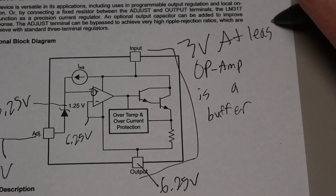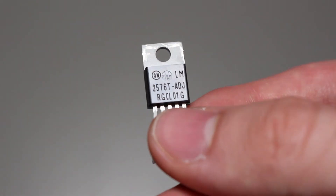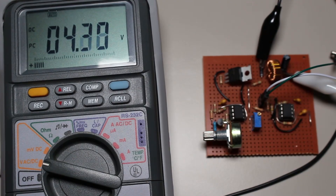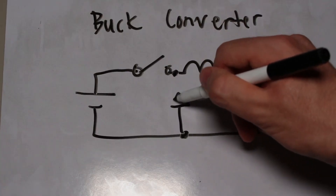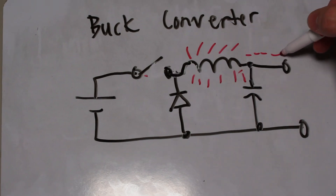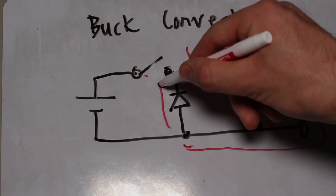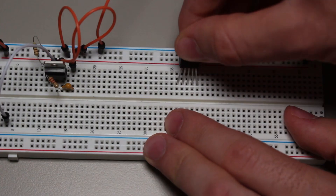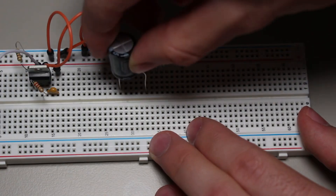Now, we can focus on the switching regulator. In this case, I will use the LM2576 adjustable version. If you have watched my previous video on buck converters, you should have a good understanding of this topic. I will give a quick review for those who are still unfamiliar with buck converters. This is the basic schematic of a buck converter, and it basically works by charging the coil up while the switch is closed. When the switch is open, the coil will discharge through the load. The diode is in place so that the coil can discharge through itself, but it also prevents the voltage source from shorting it to ground. This IC simplifies the whole process by taking care of the switching and feedback system for us, and we see that it works after following the example schematic.